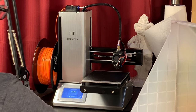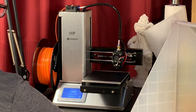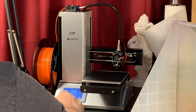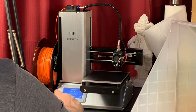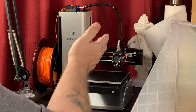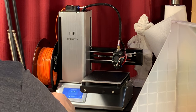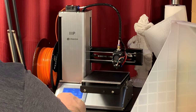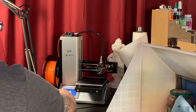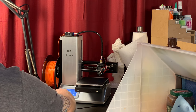Out of the factory, this printer came set at minus 0.30. The one I just returned came set at minus 0.02, so a pretty substantial difference between the two. Clearly they do try to work things out, but it doesn't look like they succeed a lot. So we're going to go past that and see what kind of results we get. I'm just using a print that I have that I know has a skirt, and I'm going to push start.